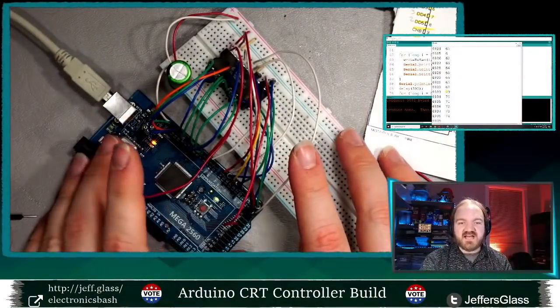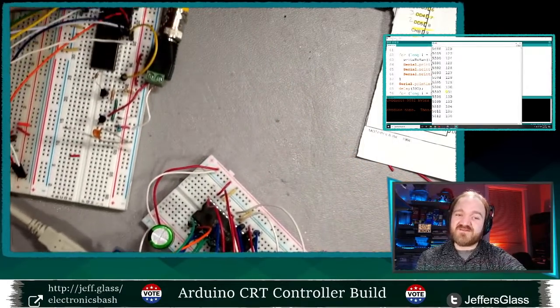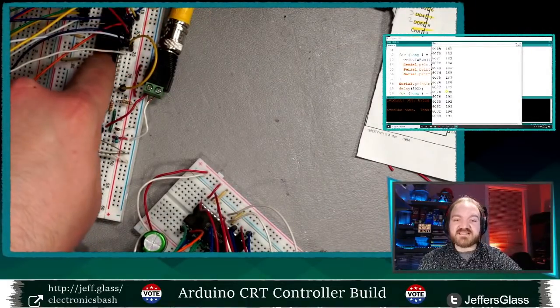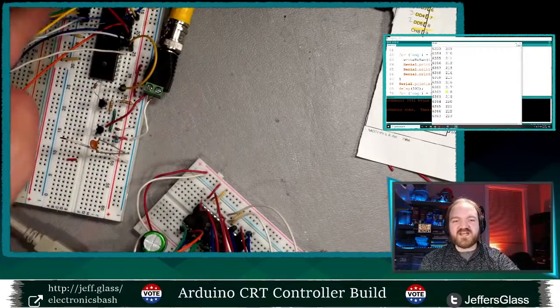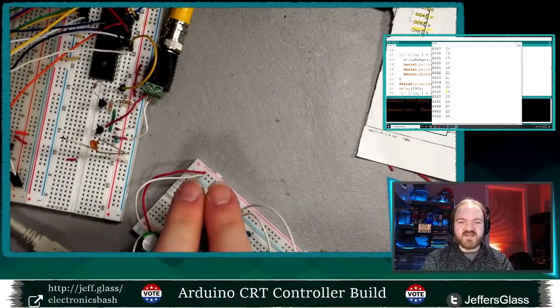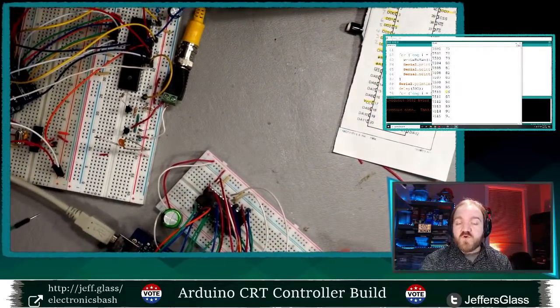Because we're going to call it a night after this is successful, here's a little prelude of the next step on this project, which I may just move ahead on, or I may do on stream. The idea of using this RAM is that you write some data into it with your microprocessor, and then you have your display chip. Remember this display chip we were working with for the first half of this thing? It has its own set of address pins. It sets an address in RAM that it's interested in and reads that value out to the video chip when it needs it. The challenging thing is that you can't be writing in from your microcontroller and reading it into the video chip at the same time. So you have a few options.